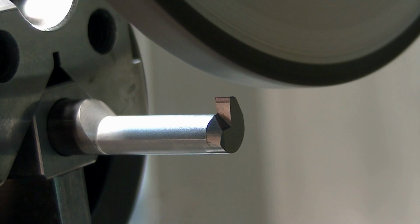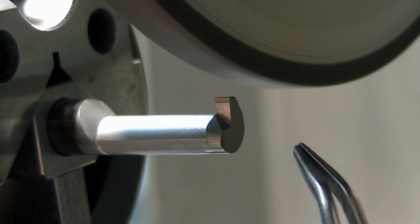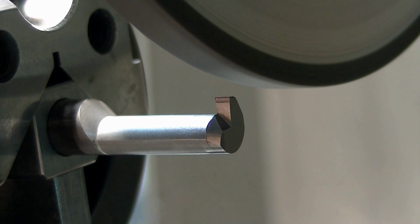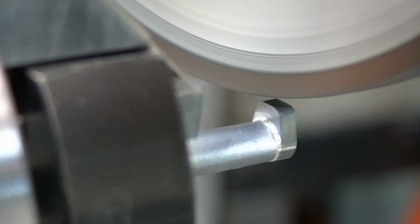One thing I forgot to mention here is that I'm grinding with the cutting direction of the grinding wheel going into the cutting edge. So it is pushing into the cutting edge as it cuts, not pulling off. Carbide being a brittle fracture mechanics type of cutting means that going the other direction would increase the amount of edge break out that would occur on the cutting edge. Here I'm going to be grinding the ones with the new heads soldered on, the 4 pieces with new heads. I'm going to be grinding them down to the same value.